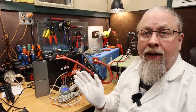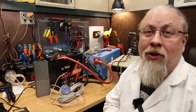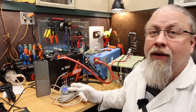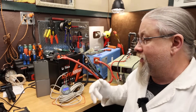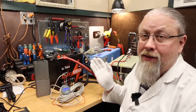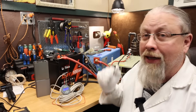The moment I turned the camera off and started shutting down for the night, the BMS shut off. It is now refusing to charge the battery over 100 amps — in fact it completely shut off charging entirely. The inverter was beeping, the rate of charge would go all the way down to zero, then back up to about 120, then back to zero. So once it gets hot enough, it does actually shut down charging. The safety mechanism is working, just a little on the slow side. The safety is there and it is built in.